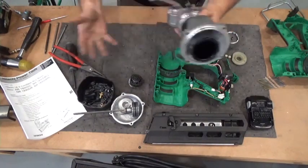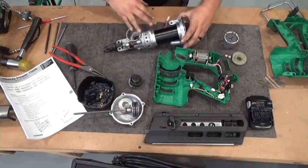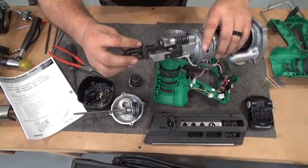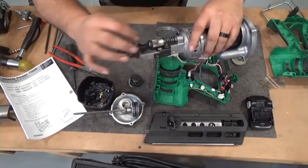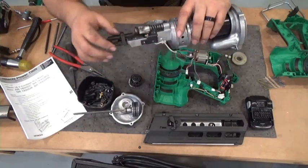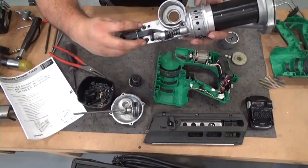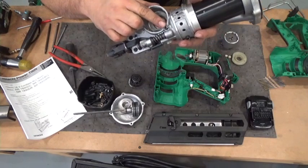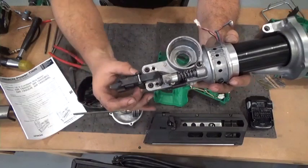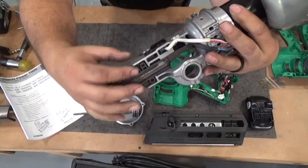So, that's the driver. That's everything. You rarely have to get into any more of this. You can get into the push lever by just popping this roll pin out, unscrewing the push lever all the way off, and then the secondary, the C push lever, comes off. If you have to redo sensors, these 2 bolts that are left in here, these 2 bolts and this bolt here takes off the nose section. So this bolt and these 2 bolts take off this nose here. So it gets to the sensors.